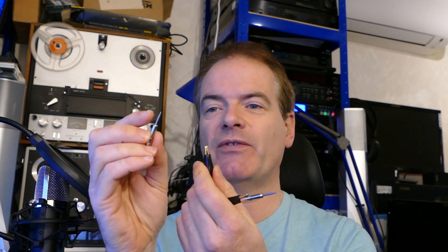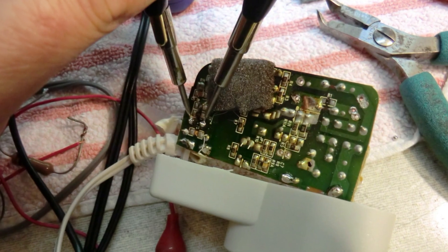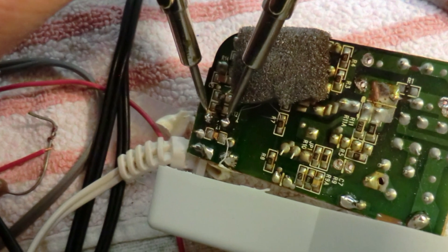Personally, I find the best way to connect to a component in a circuit is to add these short, very sharp test probes to the crocodile clips, and then I can go onto the PCB. But there's a problem: if you are holding the two probes on a capacitor for test, then you run out of hands to press the test button on the machine. New firmware on the ESR 70 Plus model has made this less of an issue, because it will wait a while while you connect the capacitor, though you could still have a situation where the ESR 70 Plus is powered down when you want to make a measurement.